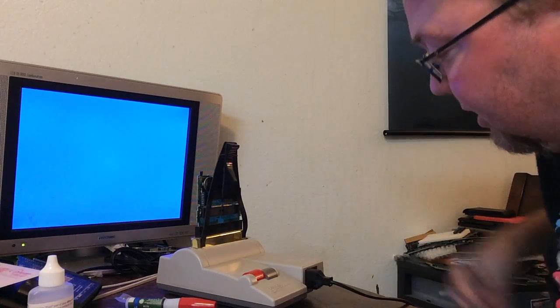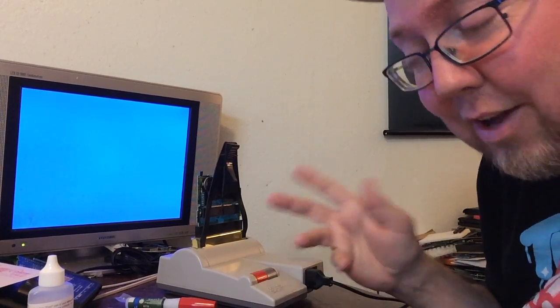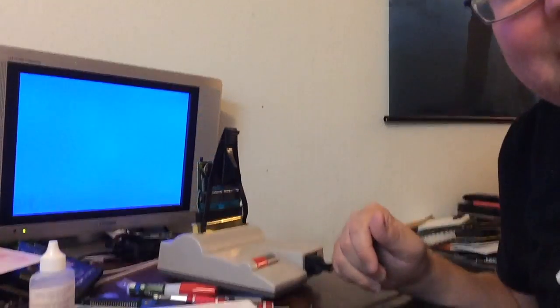It's such a fun game, unfortunately I can't fix it. Now I know it's like a week later after I filmed that first video — I actually gained about five pounds since then. As I have dinner cooking on the stove, it just dawned on me that the test board wouldn't work with all the repro redirect wires on it — that's how I use it to test on actual hardware before wiring it together. So unfortunately it's a fail, but it's still kind of a win because we know it was definitely the game, and nothing I can fix. However, it also means the old TL-ROM board should work, so I'm going to use that for a tutorial video on how to make TL-ROM repros in the very near future.